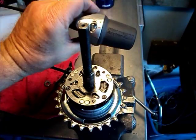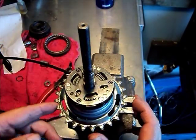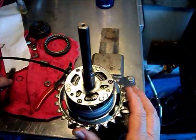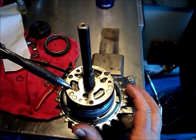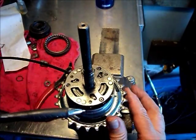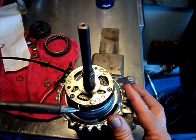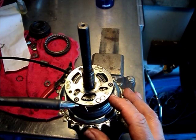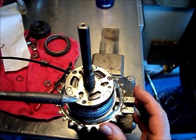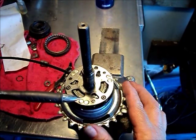Here we have stage one and the driver assembled on the axle. With the sun gear disengaged from the axle, it is free to rotate with the planetary carrier. When that happens, the planetary gears do not rotate — they simply are carried along with it and don't come into action at all. So first stage drives the second stage ring gear by means of the spring-loaded pawls at a one-to-one ratio.